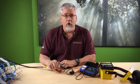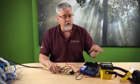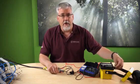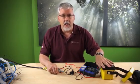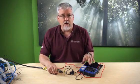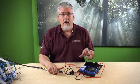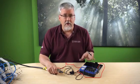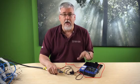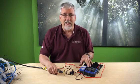The way that you test these mats, rolls, or cables is to get a mega-ohmmeter. There are two kinds of mega-ohmmeters: the old-fashioned hand crank mega-ohmmeter, which we don't really suggest using anymore, and the electronic mega-ohmmeter, which is what we suggest using now. Each cable that you put into the system needs to be tested with a mega-ohmmeter. If you don't have one, you can rent one from Warmly Yours or find one locally — many electricians have them.